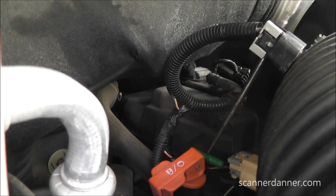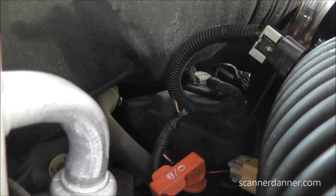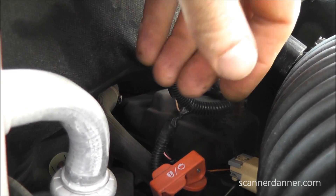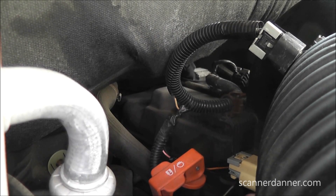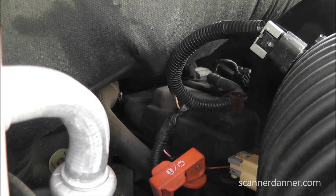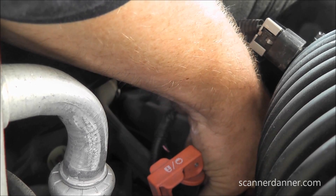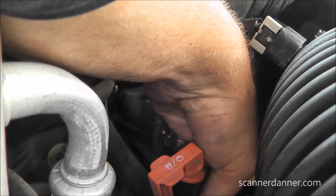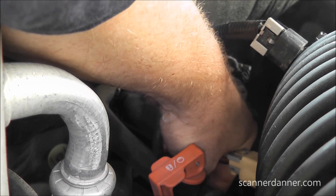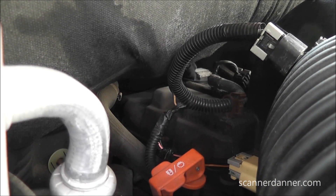We have everything we need for this thing to open, and by the sound of the pump it's not opening. I'll turn the pump on and off - with vacuum-type diverters I'd cycle the vacuum hose and listen for pitch changes in the pump. I can't do that here since it's all one unit. Listen: this is with the line plugged in. Now I'll reach down and unplug the line. You can almost hear that pressure release. Now I'll plug it back in. There is no flow through this system. That's pretty much it - we have a stuck-shut diverter solenoid valve right here.